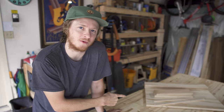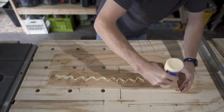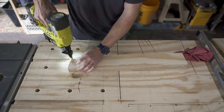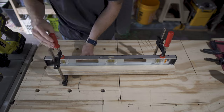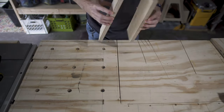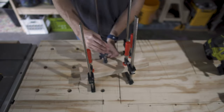Okay so now let's actually build this thing. I already have my pieces cut, but the first step would be to gather your materials and cut out your pieces. From here the first thing I'll start with is gluing together the fence pieces so that these can dry while we work on the next parts. I started by adding wood glue to both sides, then put the two sides together, lined them up, and shot a brad nail into each corner. The brad nails will keep the boards from sliding when we add the clamps. I used a level in between the boards and the clamps — this plywood had a slight bow to it, and the level acts as a straight edge to keep the boards flat until the glue has dried.